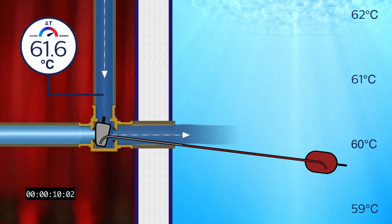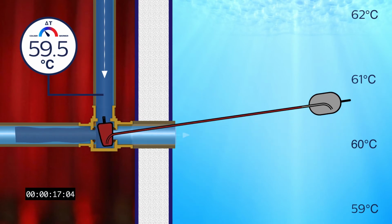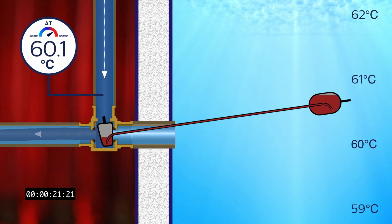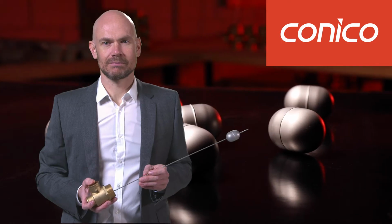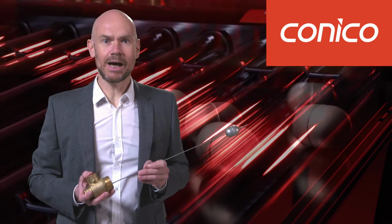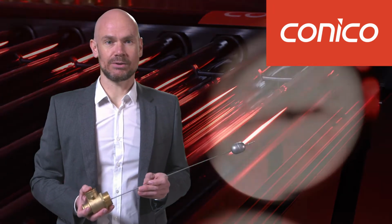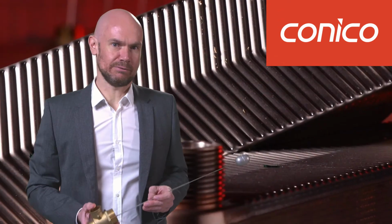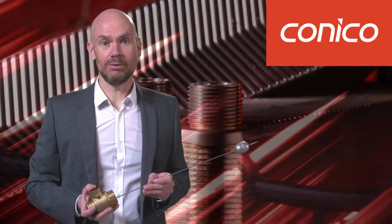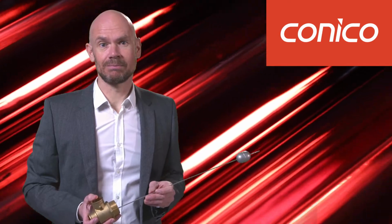When the temperature of the flow drops below the tank temperature, the empty float rises, so the valve switches to the bypass position. The other way around, the flow goes down and the valve switches to the open position. This system is highly suitable for even the most challenging thermal layering problems, since it is incredibly fast and can deal with large variations in flow rate. We have also used it to create our own innovative thermal solar system.